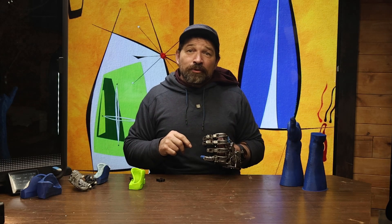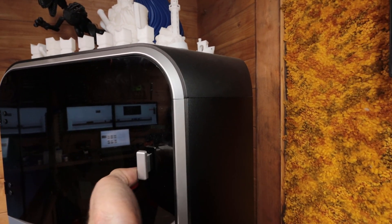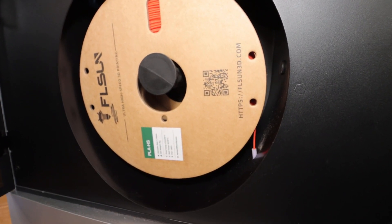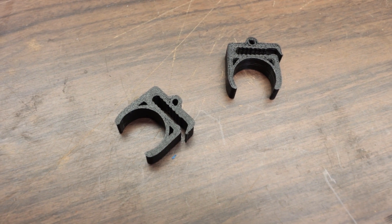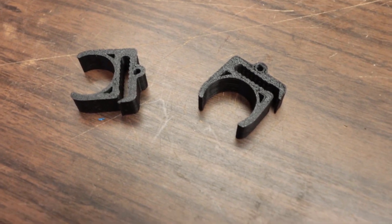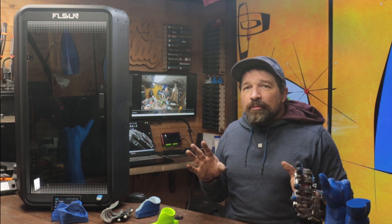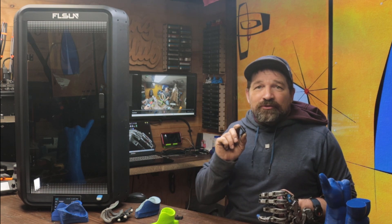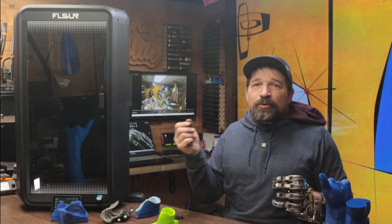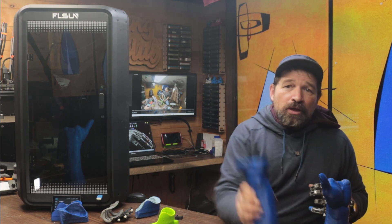For the S1 Pro, the filament is kept in its own separate heated chamber with a built-in scale that measures the approximate amount of filament left on the spool. From there, the filament travels through a PTFE tube down to the printhead. With the T1 Pro, the filament simply hangs from a couple of brackets mounted to the ceiling of the machine and is supposed to feed through the holes in the back of these two clips, then through a short piece of PTFE tube into the extruder. My experience is that when I ran the filament through the holes in these clips and printed something taller than about 220 millimeters, the filament would bind and stop feeding, causing taller prints to fail.